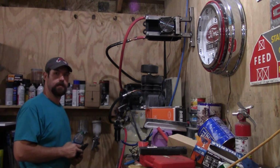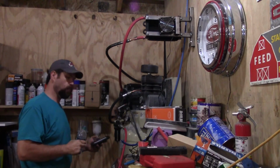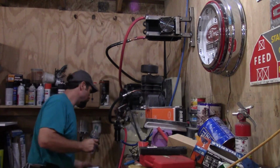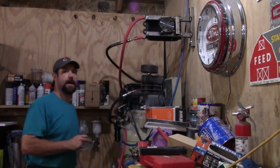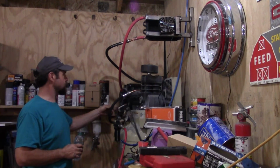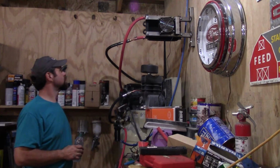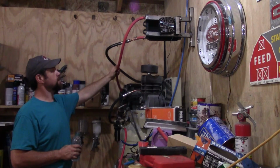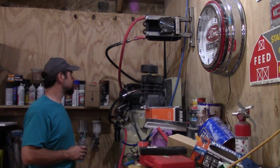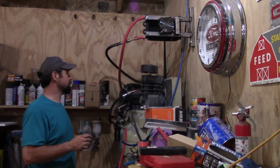A lot of water coming out of there, but guess what? It's been way over 2 minutes past where it normally fills the tank up, and I'm sitting here watching it at 59 pounds, as high as it got. I don't know, maybe it's just these hoses with too much restriction. It did build up to 100 pounds when I had my 2 rubber hoses on, but blowed out the rubber hose. And these are 1/2 inch inside diameter.